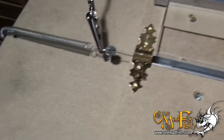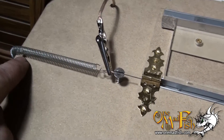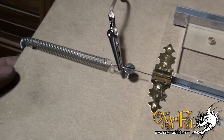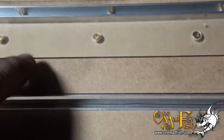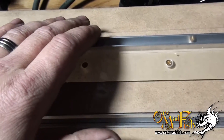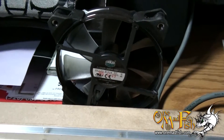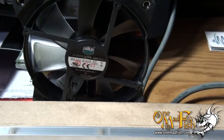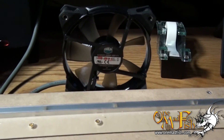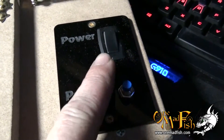I had my screw to hold the spring right there and it just wasn't strong enough, so I just wrapped it underneath and used the same hole in the bottom. A piece of aluminum channel back here helps keep this piece of wood that tips up nice and straight, because I was seeing a little bow in the wood and getting an uneven bend right in the center. Fans are 12-volt Cooler Master Fan Jets — they put out a ton of air. There's a typical power switch and a momentary push button, plus a regular rocker switch.